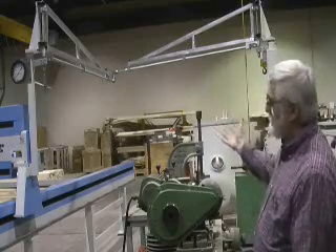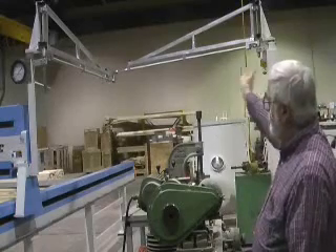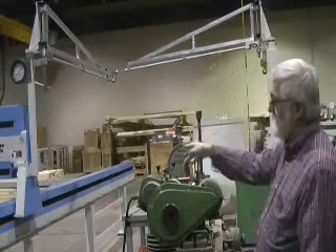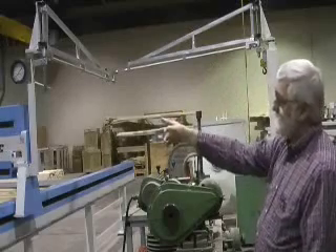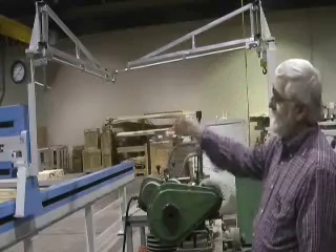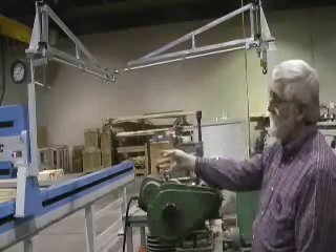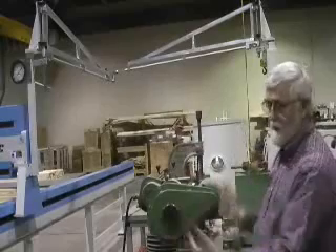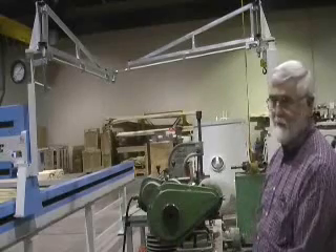What we do is we have three swivels: we simply run the high-pressure water up to the pole, up to the swivel, up to the main carriage, then we run along the back of the main beam to a central point. We then run two smaller whips from that centrally located point to each head, as each head can either move simultaneously or mirror image each other.